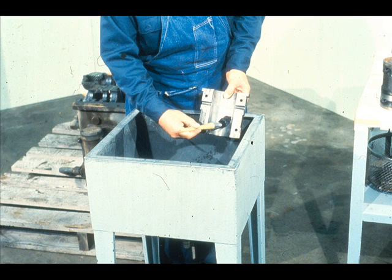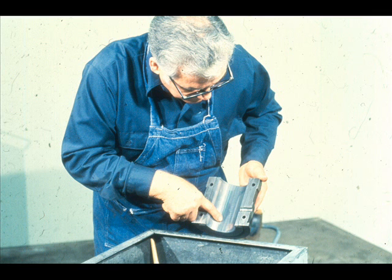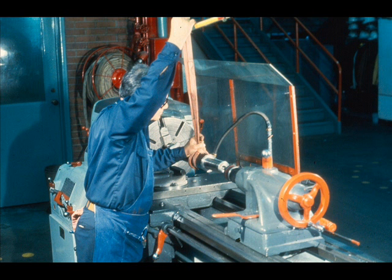As with any piece of equipment, it is necessary that all parts be thoroughly cleaned after disassembly is completed. Follow the cleaning practices which have been set up at your plant. If you have any questions on this, ask your instructor. After all parts have been carefully cleaned, they should be inspected for damage or unusual wear. This should include all parts as well as the bearings. The condition of the bearing fits on the rotating assembly is also extremely important to the efficient operation of the bearings.